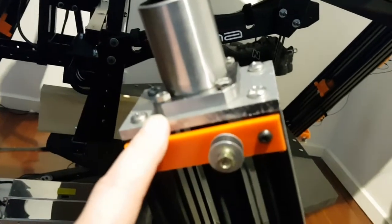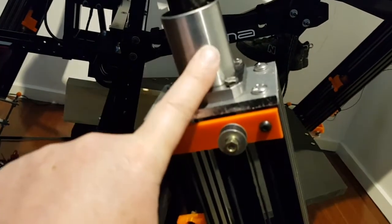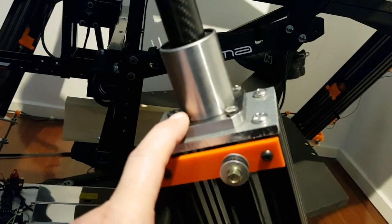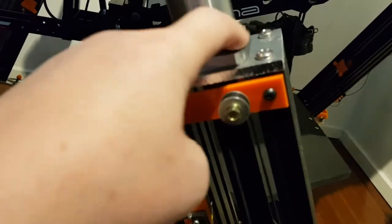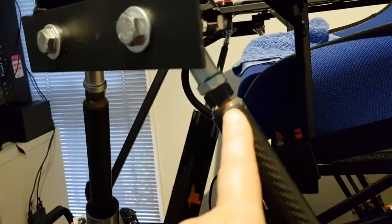That passes up through this top plate, again 6 mil aluminium, and the linear bearing. Again, this came from AliExpress, most of these bits did, and you'll see the links in the description of my build thread. So there's a 30 mil hole as it passes through here, and then up. Again, a 3D printed part which has been epoxied into the end of the carbon rod,